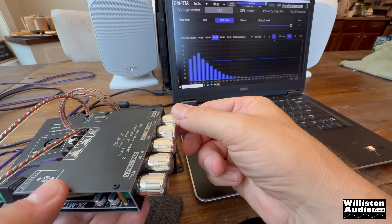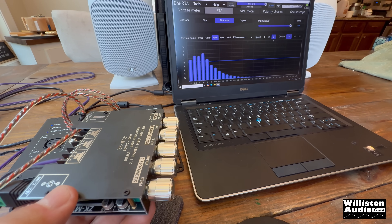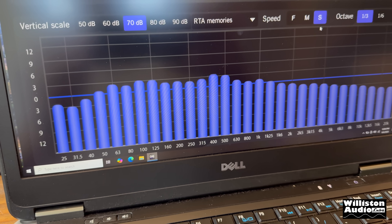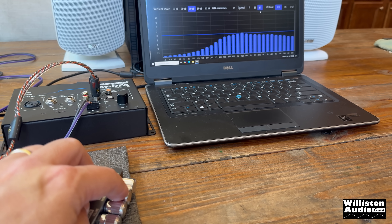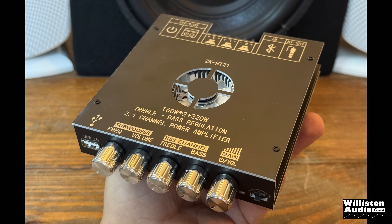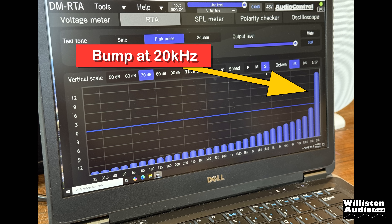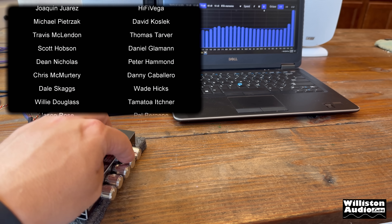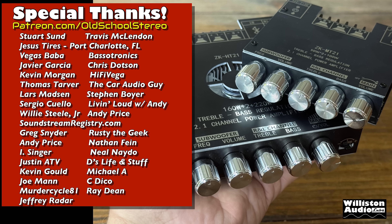For fun I hooked this up to my RTA — a real-time analyzer — showing the frequency response. You can see me playing with the sub channel to see what it does, and the sub channel works pretty good on the MT-21. I like how it's crossed over, though you had to turn the bass adjustment all the way up to get more of a flat response across the board. Moving over to the HT-21, I really couldn't believe what was showing up on the chart — at 20 kilohertz on the far right, it had a strong signal. I'm too old to hear this, so probably my dog did — it's probably why he was howling. It is something to note though. I do like the HT-21 overall. I would pass on the MT-21.